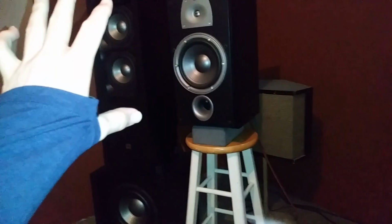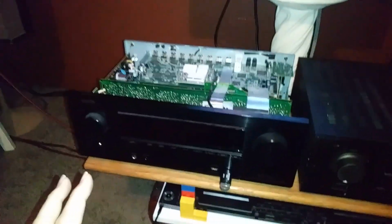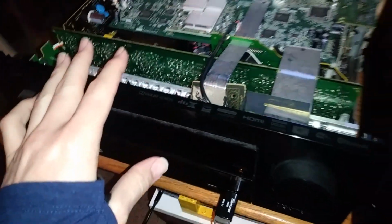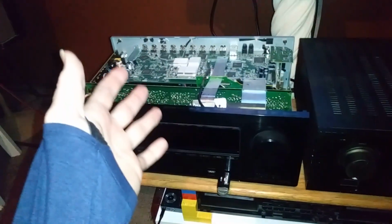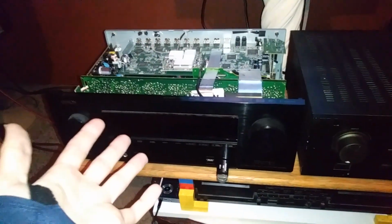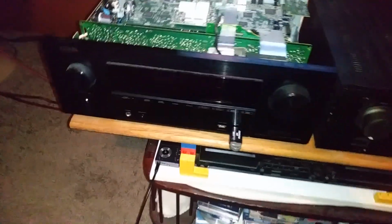Of course, the problem is it's still going to get really hot playing that loud. The speaker's still playing down to 60 hertz, and it's still requiring a lot of juice to do that. It's still going to get really hot, though not as hot as if you're playing full range bass to it. But still, you're going to have to run the air conditioning. That's the problem with Billy. It gets really hot, and people are going to shove it inside a thing where it can't get air, let alone have the air conditioning spray down on it.